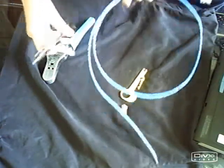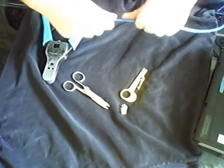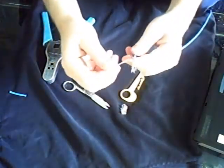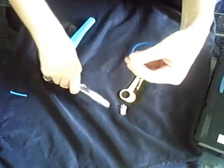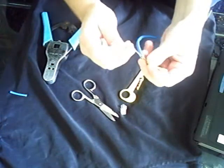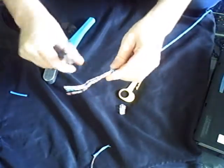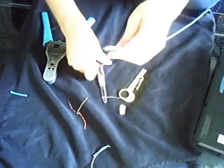I'm going to use the scissors on the bare end of the cable. I leave about an inch and a half, just nick it and break it off. If you make sure you didn't nick the wires inside, you're fine. If you did, you could use the pull string inside to open up the jacket a little bit, pull on the string, then pull more cable — that section won't be damaged. Then cut it off nice and flush. About an inch and a half exposed — a bit long at first, but it's easier to work with.